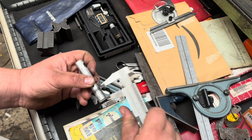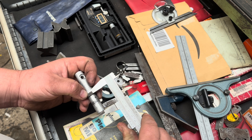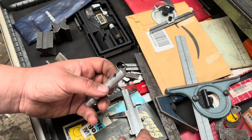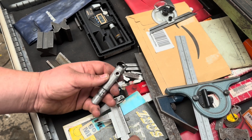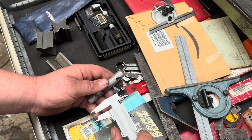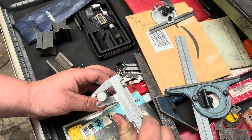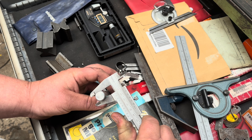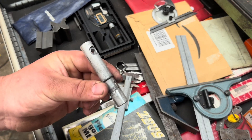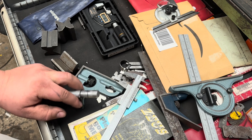The centre of the first circlip groove is probably 20mm from the end, and the centre of the groove for the second one is probably about 37mm. We've got a cross hole that's counterbored on one side - that's 7mm. And the counterbore means the shaft is 13.34mm. So that's our first thing to make, and we're going to make that out of a bit of stainless 304. Then we can work on the arm - a pair of them to make.